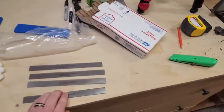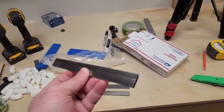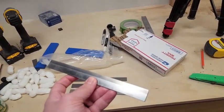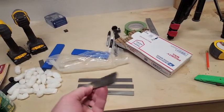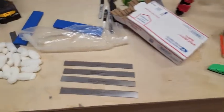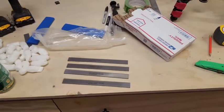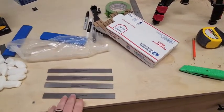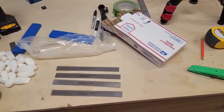I thought I could get these high speed steel blades with a carbide insert — you can kind of see it there. They basically take a strip of carbide and somehow anneal or bond it to the high speed steel, because carbide is really good for cutting, especially with dense materials. But it's not very pliable like steel, so the only way to put carbide in a blade like this is basically just weld an insert to it.